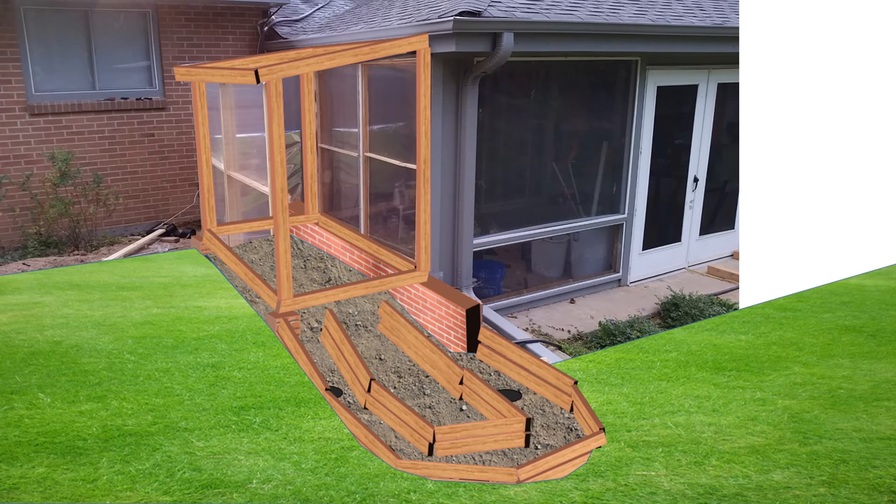Next, I build up a wood frame using scrap lumber. The idea is to have ample space to handle the ductwork used to blow air — whether too hot or too cold — down into the holes to moderate the temperature, and then have enough space for the return air back to the greenhouse. This wood frame gives me ample space to hold and support the pipes, keep them from getting stepped on, and then I can staple plastic on top to make it airtight.